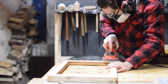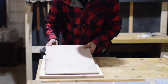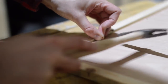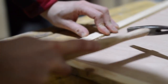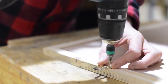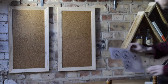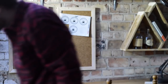The glue had dried and I gave the frame a quick sand. I'm just going to leave it unfinished and natural. Then the cork tiles can be put in place, held in with some little panel pins. I want these to be easy to take off the wall as I use this bit of wall for photo shoots, so a little keyhole plate would make it easy to take on and off. And that's them all done — now I've got somewhere to keep my stickers. Thanks for watching and please subscribe for more videos.